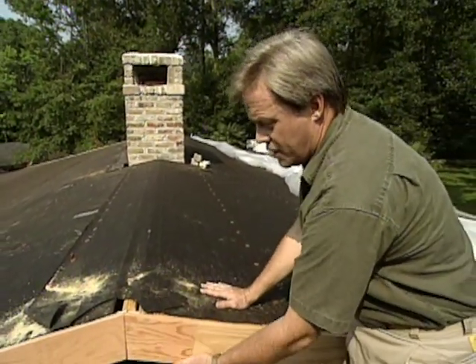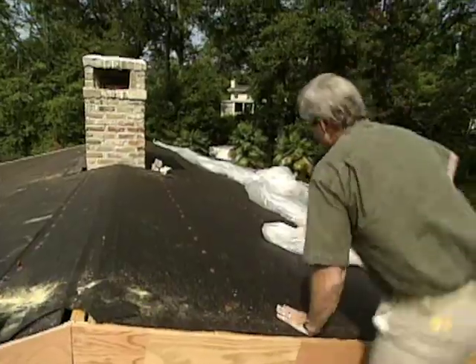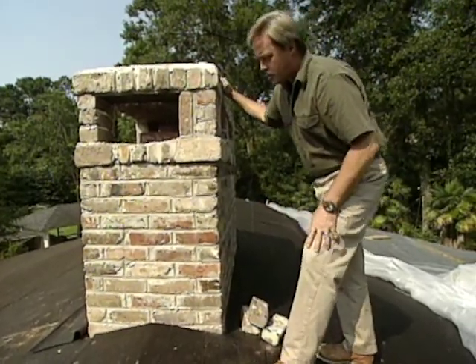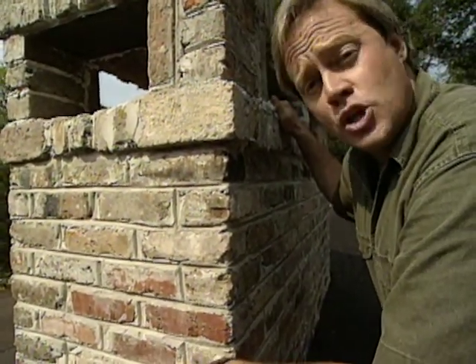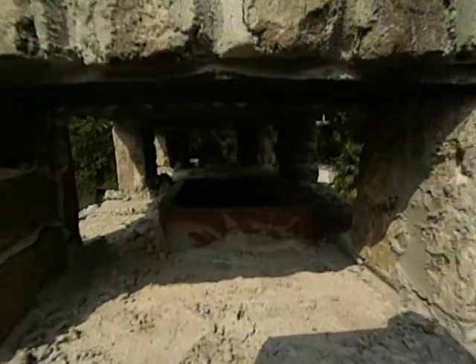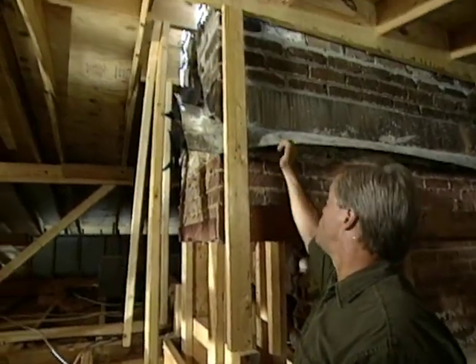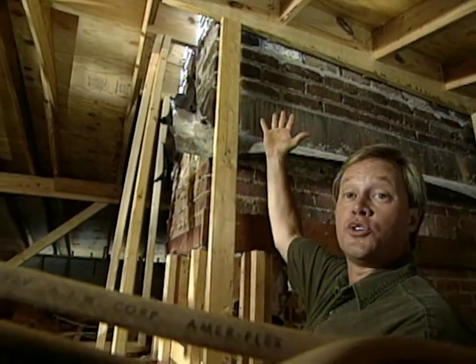Because of the work we did in raising the roof up, it required us to also extend the chimney very early in the process. The original cap was taken off and we had the brick mason brick it on up and put the new cap on before any work took place around it. This is very important because brick masonry work is very messy — if we had new shingles here, it would cause a lot of damage. This way, when the roofer installs the shingles, he can put his flashing on and complete everything. You can see where the original roof tied right into the chimney at the point where the metal flashing is — the metal flashing laid on top of the shingles to keep all of the rain out. This gives you an idea of how high we had to raise the actual roof structure.